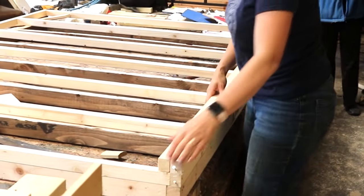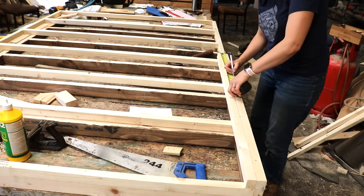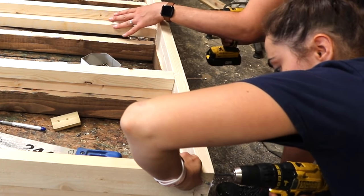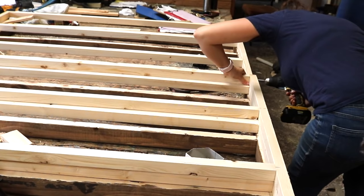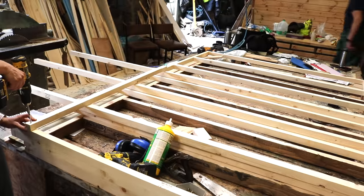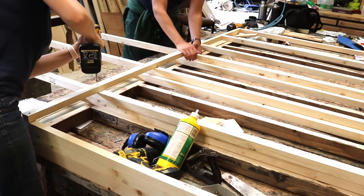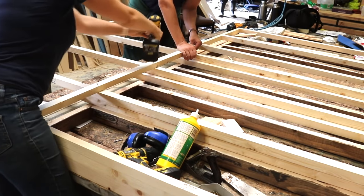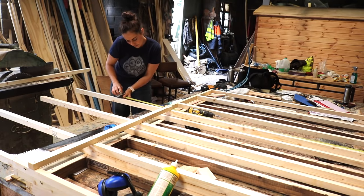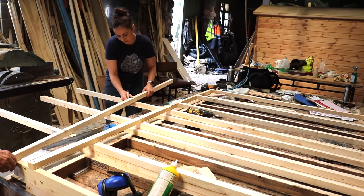I've got the top and bottom section together so I can quickly mark where the spars will go. Then me and my husband, working as a team, screw long spars where the pencil lines are. But because we're going to cut the spars to form a slope, the upright ones are longer than we need. That top piece with the marks is then temporarily lined up and screwed on the upright spars to stop them moving. To get the slope, I needed to transfer the height of the shortest side of the shed, then measured and marked our desired height on the opposite side. And to get that continuous slope, I positioned a straight edge in line with those two marks.